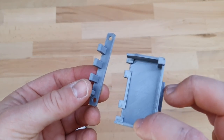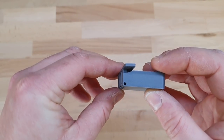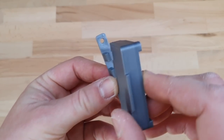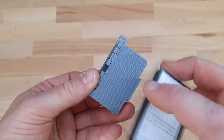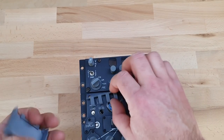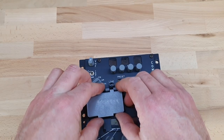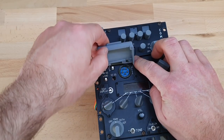Here's the old VHF cover - it was just a static piece. And here's the new one I've just designed and 3D printed - you can see it's a hinge. It just goes in like that and I'll put a brass rod down the center so it will be able to hinge up. I can put a spring on it to keep it sprung down, but I don't think I will. Once I sand it and paint it up I'll put one of these stickers on there, and it gets bolted onto the top here - the hinge goes through that hole and it should sit perfectly and hinge up like the real one.